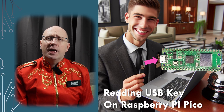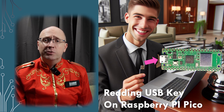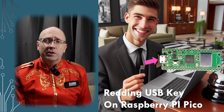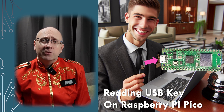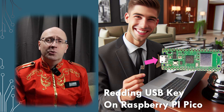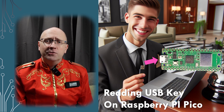I've talked about using flash on the Pico as non-volatile storage, holding data between resets. We could add external flash or EEPROM devices over I2C or SPI as an extension to that. You can even connect SD cards to an SPI interface. I am missing the obvious here though — the easiest non-volatile storage approach to use is surely USB memory drives. Let's explore that.